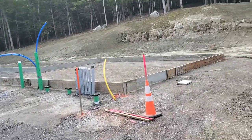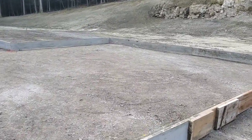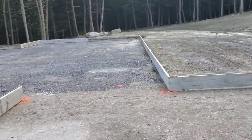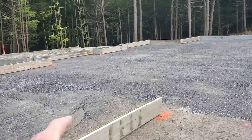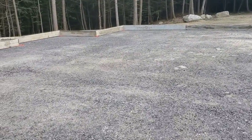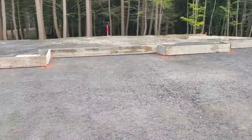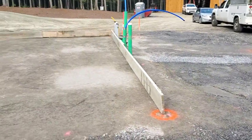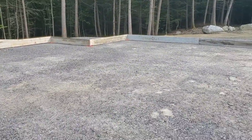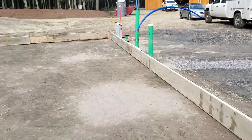I got it all formed up, probably took me a couple hours. Darren and Luke did show up right at the end to help me set it to grade. So we got all forms set to those pins, straightened it with a string and some stakes, and got it set to grade. Now we're just waiting for the plumber - we leave this off so they can get a mini excavator in here to dig out for all the plumbing. There's a couple bathrooms and a kitchen. They'll dig this all up, but they need the forms up and square so they can measure off them and get the right height for all their plumbing. We did our part, now they got to do theirs. Then they're gonna lay styrofoam radiant heat and we'll come back and pour it - probably a couple weeks before we get back to this one.